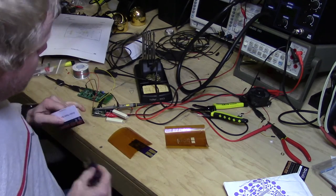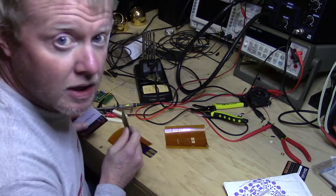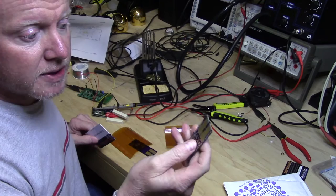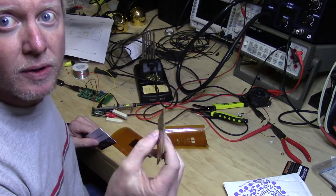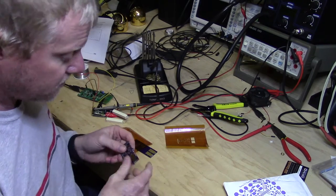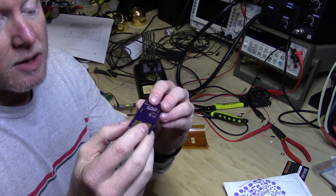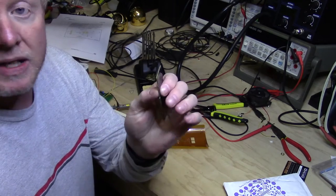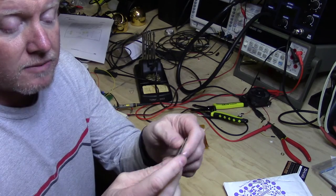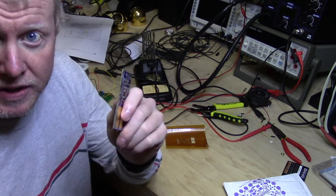In the prior video, we made sure that the actual chipset that we want to use for power control does work. So as long as we can get outputs on these pins, this should work. This should actually give us enough to test 485, all the outputs and inputs, and especially the opto isolation on the 12 volt. All that circuitry's on here. So I'll get started and I'll get this stenciled and we'll put it in the reflow oven and flow it real quick.